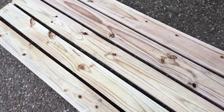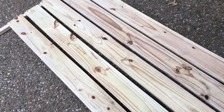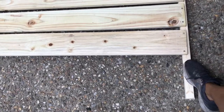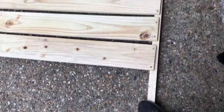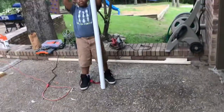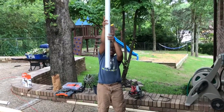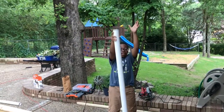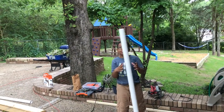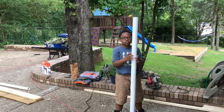This bottom half piece of the post — we're going to create an insert into the ground using PVC. I'm going to cut a fifteen-inch piece of PVC at a forty-five degree angle so that we can install it a little bit better in the ground, and then we'll just stick the post in. Stay tuned.